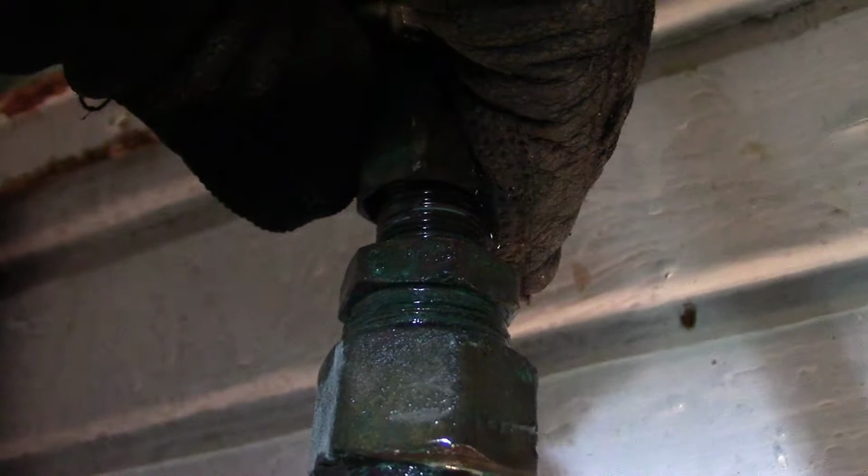So this water line was on here like this, and I just took that off with the crescent wrench. Okay, so hand me one of them silver pipes, you know, with the braids. These things here, they'll screw right on there. Okay, so that fits, and then that'll go on the bottom of the sink. So we're good to go there. Now the problem is these things, if we wanted to get these to go on here, you need a different type of fitting here.